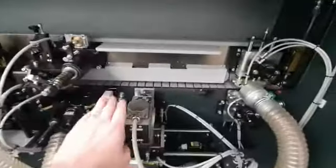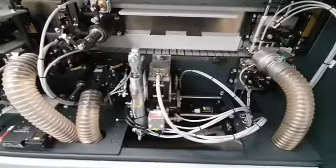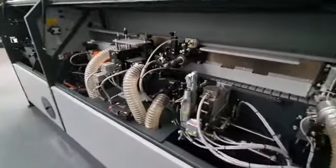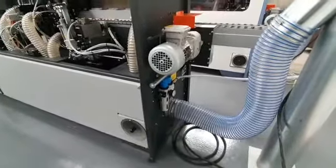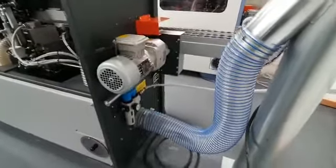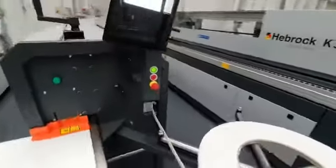The F4 comes standard with corner rounding, also adjustable from the front end. There is also a set of flat scrapers, or glue scrapers, that can be switched on or off from the touchscreen control. The machine is compact and easy to connect services — all mounted from one end, with a 140mm outlet from the back, and compressed air and power from the same end.